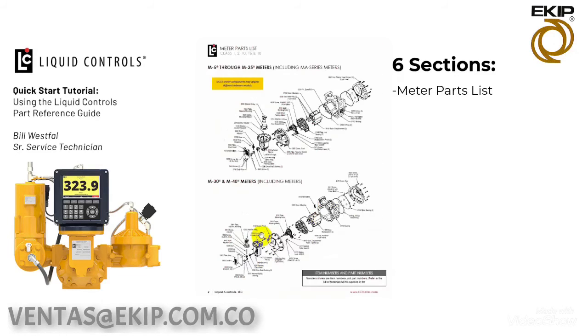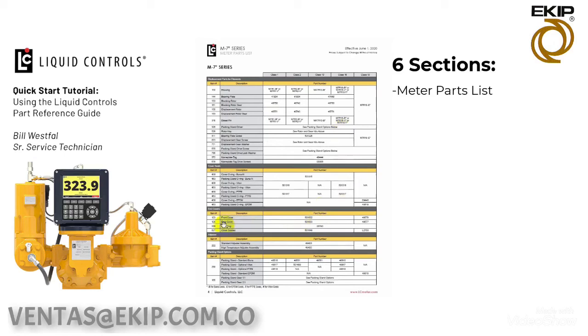So let's go back to the drawing and let's look at the seal. In this, for an M7, we're looking at a cover O-ring of 0430. So if we go back to the parts list, here is our 430 cover O-ring in Buna, and here is the part number, 501315. So this is going to be a kit that will contain the cover O-ring for the M7 Class 1, Class 2, Class 10, and Class 16. In the case of the Class 18, it is not available. But if you look at the cover O-ring in EPDM, it is available underneath these two separate part numbers.